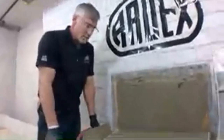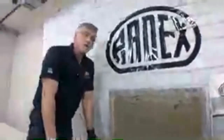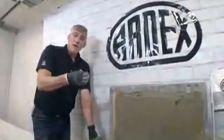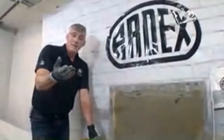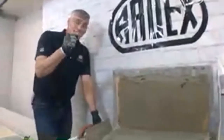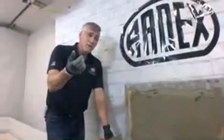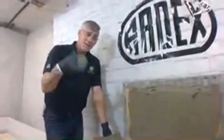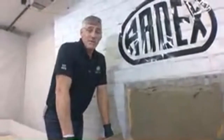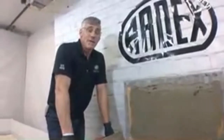How thick does AM100 need to be when installed over wire lath for a brown coat application? So for a scratch and brown, we're going to go directly over top of the wire. Like if we're doing an exterior veneer installation, we're going to go directly over top of that wire. And we can just go the minimum thickness of 1/4 inch over that wire and scratch that and then come back with our brown. Or you could do it as a single step too, either way.